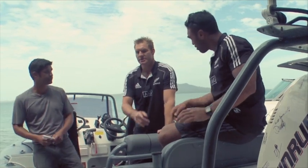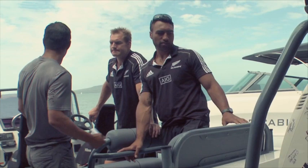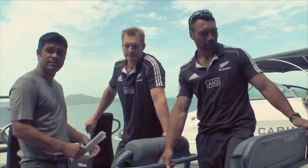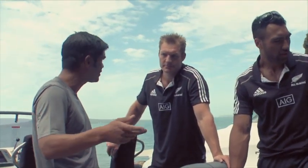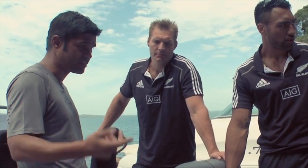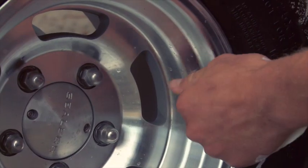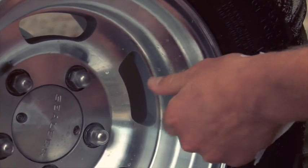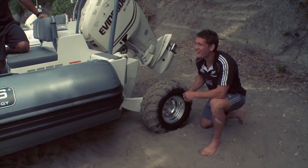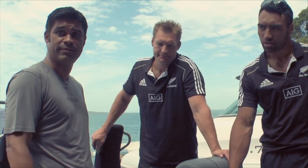Can you change the tire pressure, and why would you need to? Sometimes the boats get stuck — you might find you've driven up a strange bank that's a bit sandy or muddy and got your wheels well stuck. The best thing you do is jump out of the boat and let the tire pressure out to about 5 psi, where the wall of the tire just starts to break. You'll get a lot more traction out of the wheel and probably be able to drive out of where you came from.